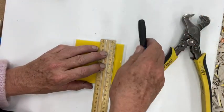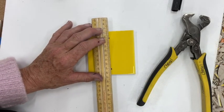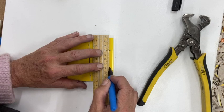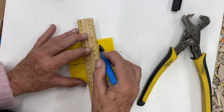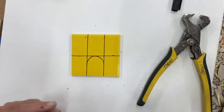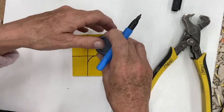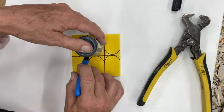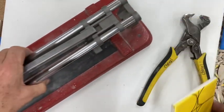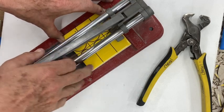Select your tile. I'm using my permanent marker and I'm marking the tile in half and ruling that line. Now I'm going to mark this tile into thirds — it's a 10 centimetre tile so it's roughly three centimetres, three and a half centimetres down. Now I'm going to put the curve in the middle because that's going to be easier to nip. I'm actually going to use the lid off one of the bottles in the studio — if you're not confident about drawing your own curve, use something you can find that's around. To cut this I'm using a small tile cutter from Bunnings — it's easy to use, I'm sliding and pressing down and it snapped.